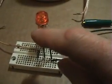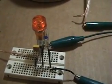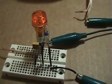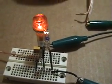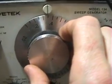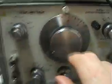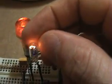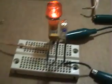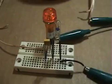What you do now is try a lower capacitor value — like the next one down, or jump further down. I'll shut this off, change the capacitance to 270 picofarads, and sweep again. There we go — we're resonating at a little higher frequency, around 350 kilohertz. The bulb is still lighting but the intensity is less, so we're on the right path. We have to keep going down.